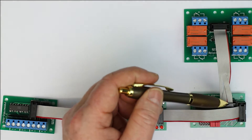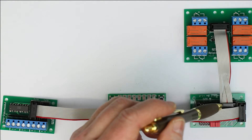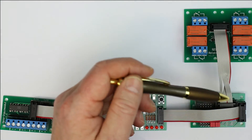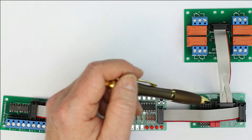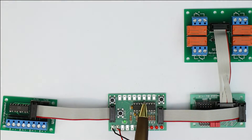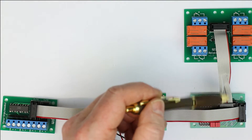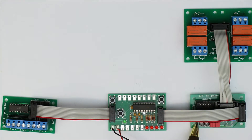Because this is a very universal module, we had to use a special crossed ribbon cable for the connection, and you have to use output number 2. Output number 1 will not work because it has a different purpose. For our TPS controller board, you have to use output 2 and the special crossed ribbon cable that we provide with the PCB.